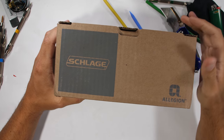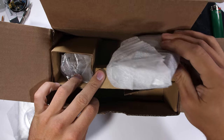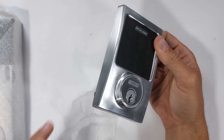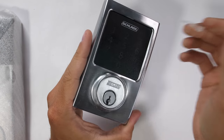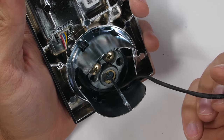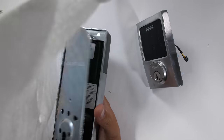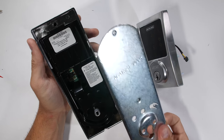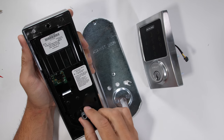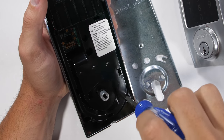This residential door lock claims to be pretty intelligent, but today we're going to find out how smart it is ourselves with a little installation and a review from the inside. The first component out of the box — and the only portion on the outside of the door — is the keypad, which appears to have solid metal construction and a couple internal Phillips head screws holding the locking mechanism in place. The other chunk of the housing is what goes on the inside of the door, with a metal mounting plate and three screws holding the guts to the metal exterior. We don't have to worry much about this half of the lock because an intruder wouldn't have access since it's inside the door, but we're still going to take it apart anyway.